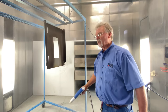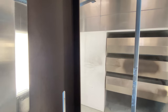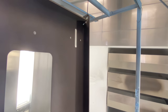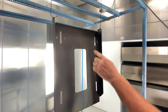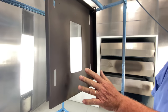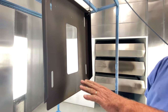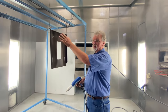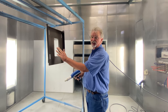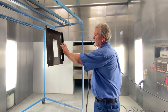Let's take a look at these Faradays now. You can see we've got good coverage in all the corners, all the way around. What you'll notice here in the Faradays is that as I got those, I was also getting a lot of the surface here with powder. That's why we do the Faradays first — we coat them first and then we see how much we need to put on the adjacent areas. If you did the adjacent areas first and then tried to get powder in the corners, you're going to get a heavier film build in that section.